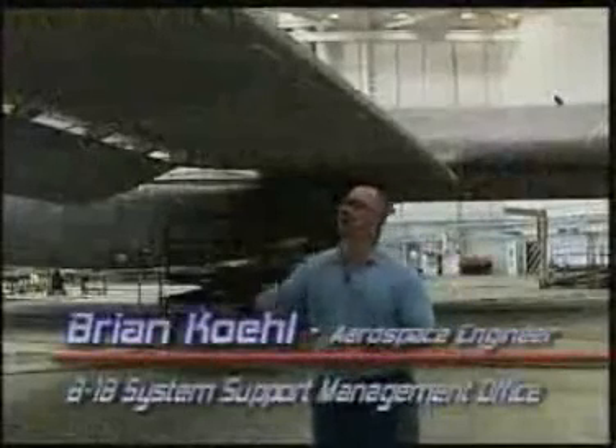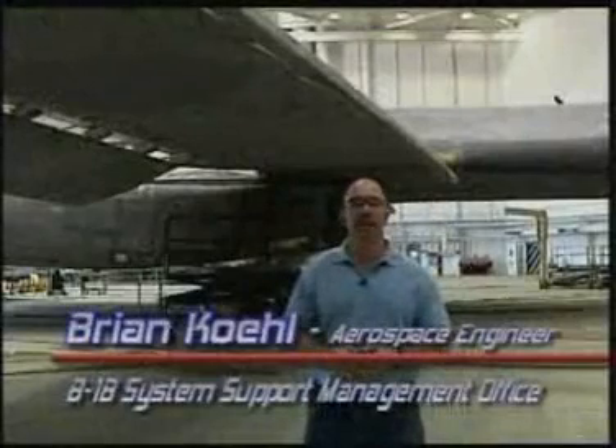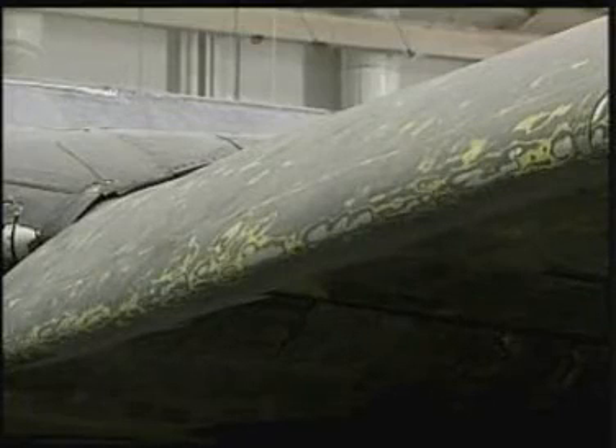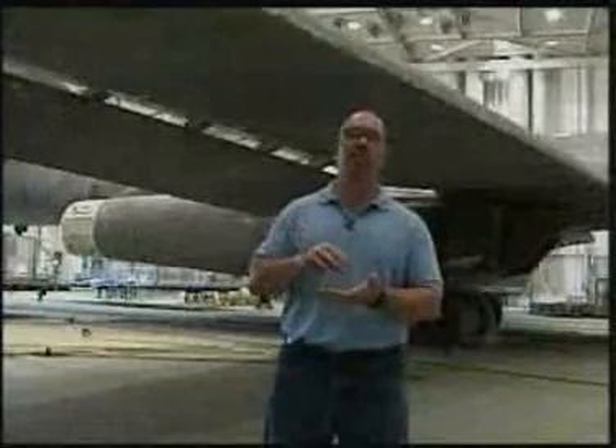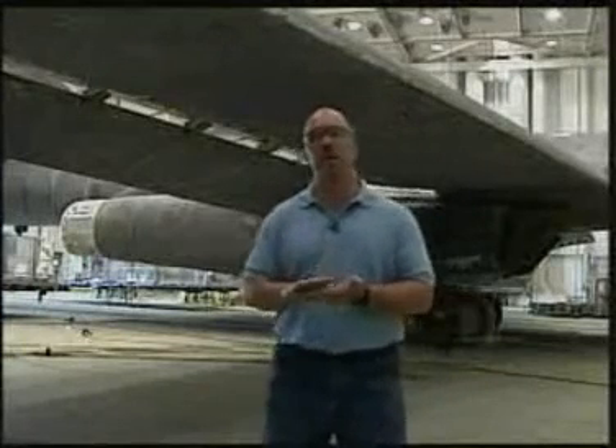We're looking at pre-coat to apply to our wing leading edges. We've had problems with paint adhesion in those areas — some of our deployed aircraft out in the desert after two or three flights have seen degradation of the coating on the leading edges. We're going to apply a pre-coat application to this aircraft after it's been scuff sanded. After scuff sanding, you have dust from your paint that's been sanded off, and oxide has built up on that coating. The pre-coat will remove all that residue, including hydraulic fluid and fuel, so we get a good bonding surface. It will prep the pores of the aluminum substrate at a molecular level by filling in those voids, giving more surface area for the primer and top coat to adhere, resulting in better paint adhesion.